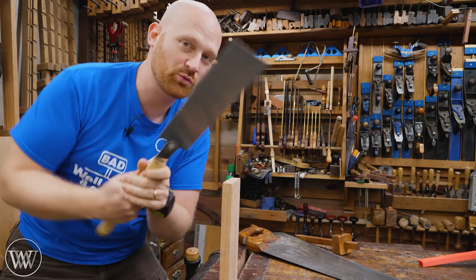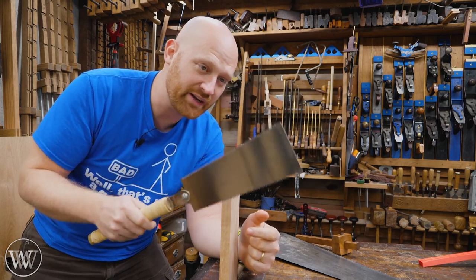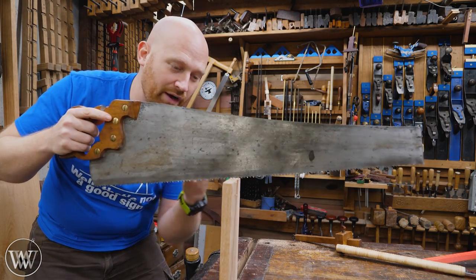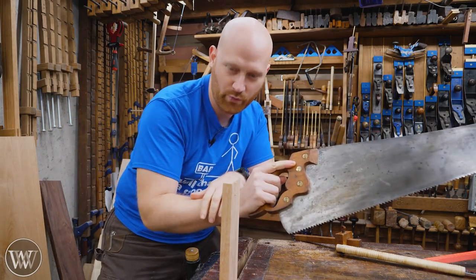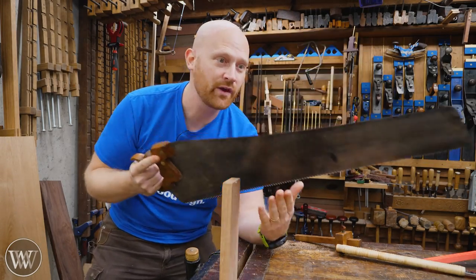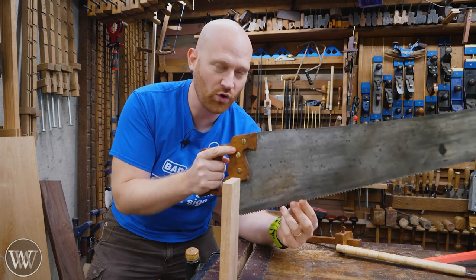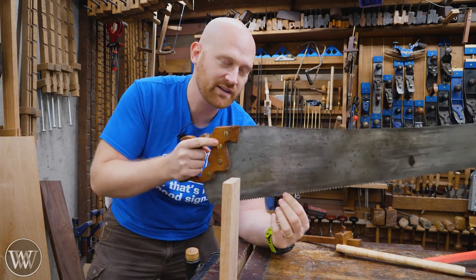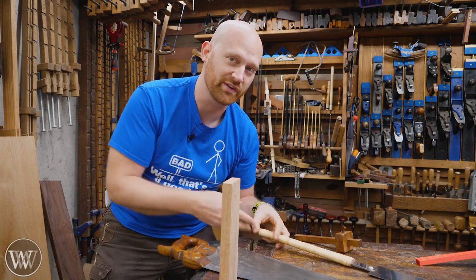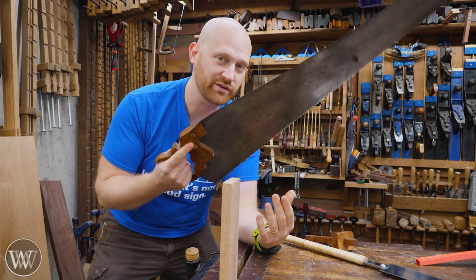Your hand is back here, so you can do a lot of twisting before this saw does anything. You do have some control, but you have to do a lot of finagling. If it goes offline, it's really hard to bring it back on. The nice thing for a beginner is that if you set it up true, it's going to track true and go straight down your line. The problem with a western saw is the leading tooth is now on your side of the board. Any slight twitch or movement in your hand, wrist, elbow, or shoulder has to be in perfect alignment — otherwise the saw starts going off to one side and becomes very difficult to control. However, that means you have all the control: a slight movement of the hand can make the saw come back online. A western saw is much harder for beginners, but once you've put the time in and get control over it, you have a lot more you can do with it.